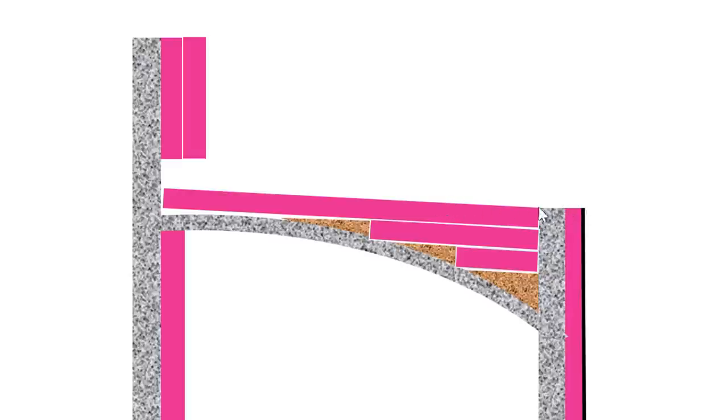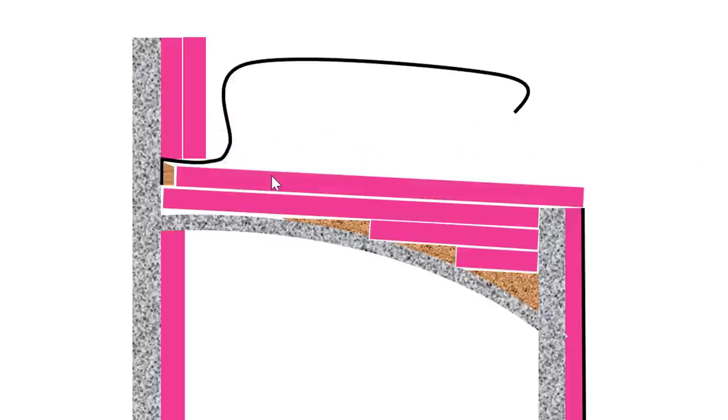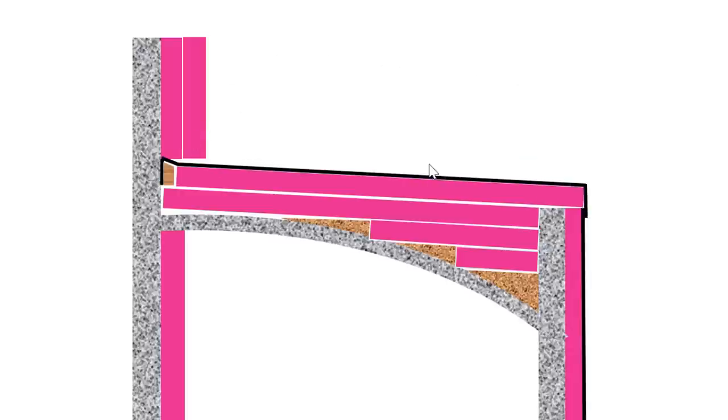But first I need to attach the rubber pond liner to this inner wall. I'm doing it now so I can get that treated wood strip and the screws in there, then tuck the last layer of insulation in there and totally fill that gap. I pull the rubber down and overlap the north wall waterproofing. Any water that lands on top of this will drain over the top of the wall and down the outside edge. Then we have a lath on the outside edge and we stuccoed right over it. I also squirted some spray foam in that top gap to keep any water from getting in there.